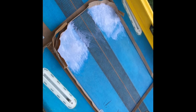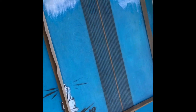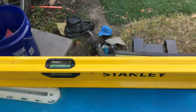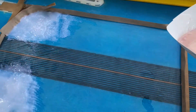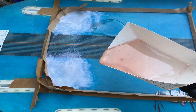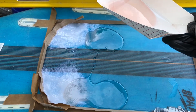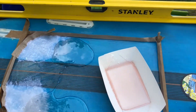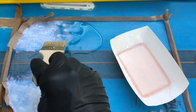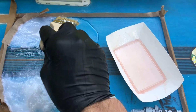I had two sections that were going to be really deep. I could have used pure resin, but it's lighter to mix it with some microbeads. That's why it looks a little lighter. So I filled the really thick parts first with that microbeads mixture — you can see I'm still level. Then this is just pure epoxy resin and I'm going to pour it in there. You can thin the resin if you want. I kind of chose a hot day to make this happen and it's still not flowing as nice as I would have liked, so I'm going to push it out.